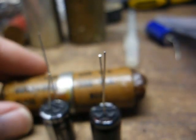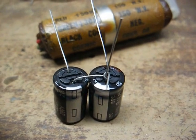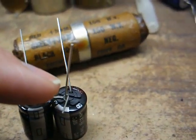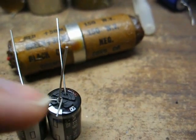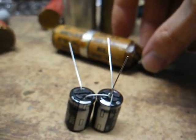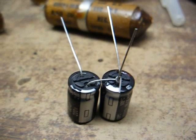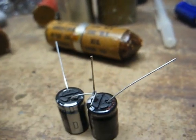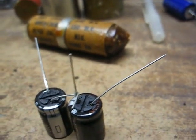These two modern capacitors are much smaller than the original. To do this, I'll tie the two negative ends of the new capacitors together and solder them. I'm not actually installing this in a set, but if I were, all exposed leads would be insulated with either heat shrink tubing or spaghetti tubing. We'd solder the negatives together, cut off the excess, slide heat shrink tubing over the leads, and solder everything together thoroughly.